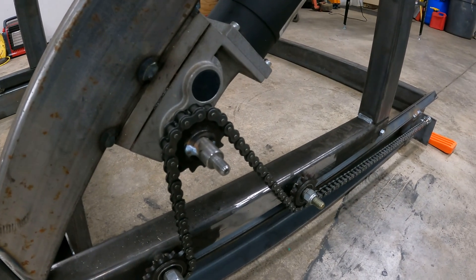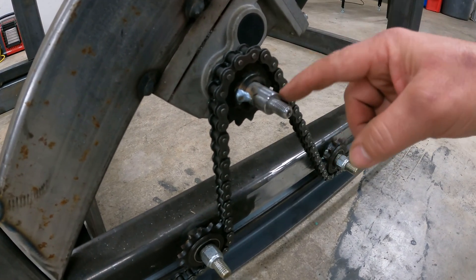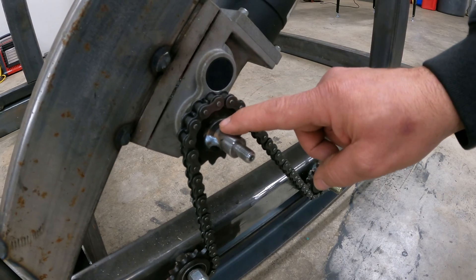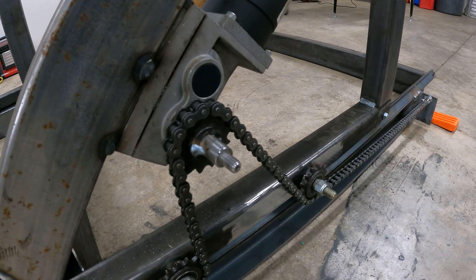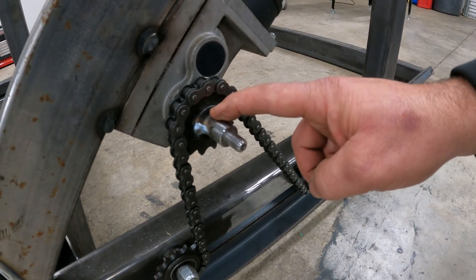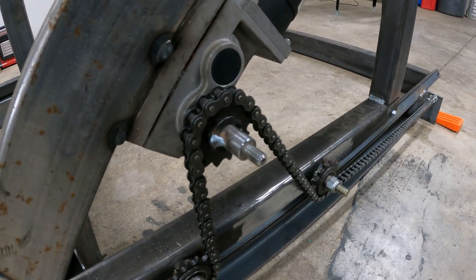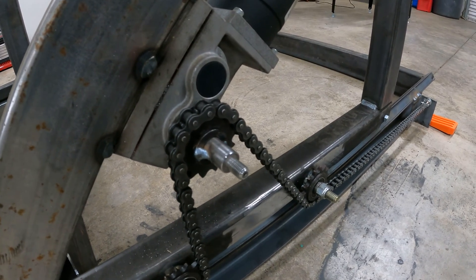My biggest complaint, really the only complaint that I have with these motors, is the shaft. It's like a 17 millimeter smooth shaft and way out here you've got some threads. So what I had to do — I had to buy a 17 millimeter sprocket, but I couldn't find one in a number 40 chain tooth configuration. So I pretty much took a small 17 millimeter hub sprocket, cut the small sprocket off, went to Tractor Supply and got a number 40 sprocket, did a little bit of truing up, and used a press to press that on there. Then I just tack welded it on that shaft, but it seems to be working great.